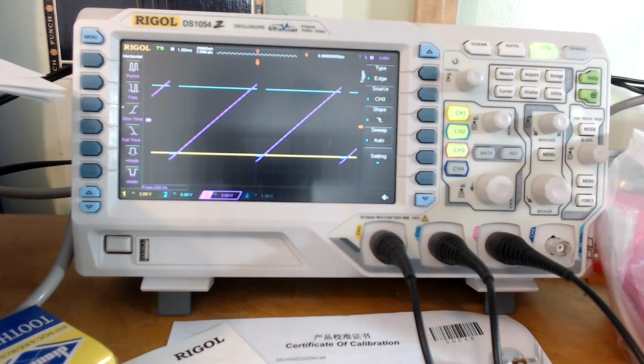But from what I've seen, the ramp wave amplitude is rock steady if you don't change anything. And if you do change the frequency, I went from 200 hertz to 2000 hertz, and the amplitude changed by about 1.5%. So that would suggest that if you didn't do it this way, the pulse width might change by a couple percent, but that hardly seems worth worrying about. So I don't really know what Wilson was worrying about. Maybe I'm overlooking something.